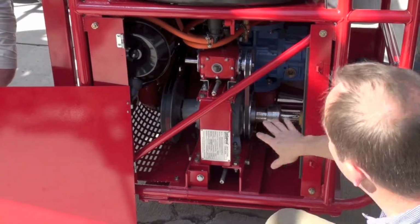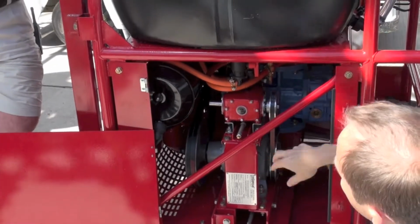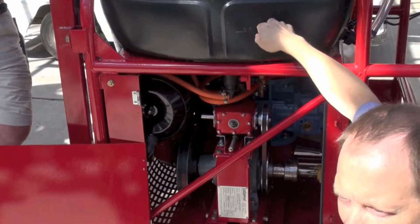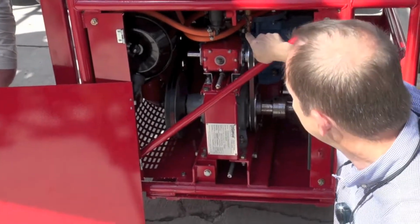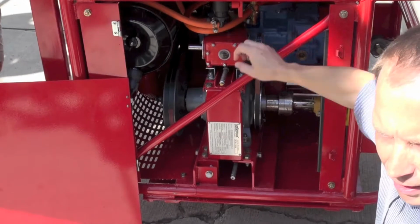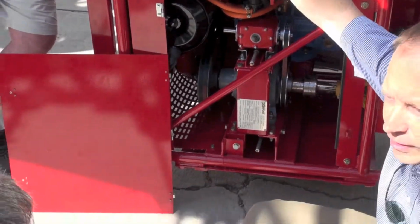In here, sucking air in for the blower, forcing air up into there. The pump is going to send 350 psi back to this tank for agitation, and it's going to send 80, and we do that through a special bypass loop there that's got some restriction on it. So it's got a constant 80 psi. That's what runs to the nozzles.